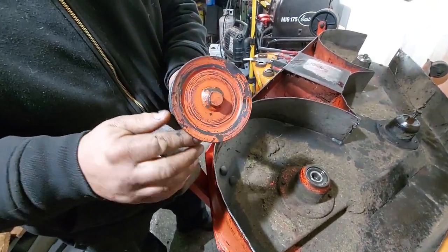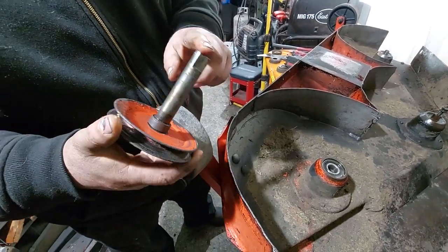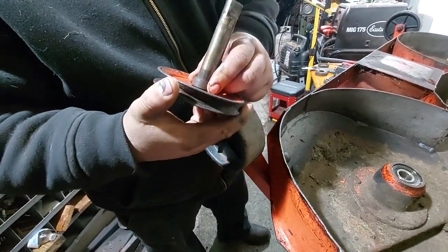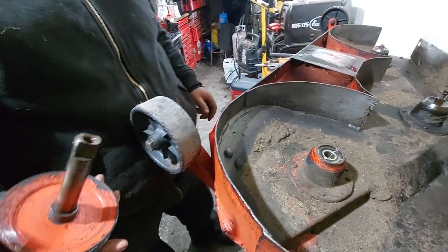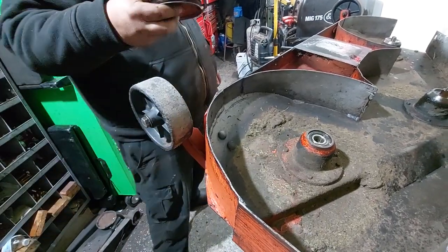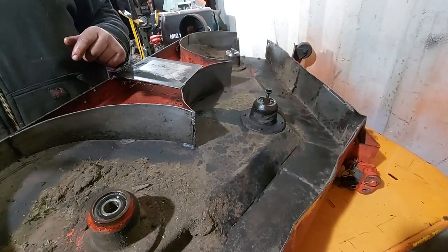That's it — that's how they should come out, doesn't mean they always do. Like I said, the pulleys are welded on here, so if your pulley is shot you're kind of out of luck — you have to buy the whole spindle. We've got a spacer on here, so you have to remember to put that back on. Pay attention that nothing else fell and dropped, as sometimes there are spacers up above. The two outer ones should always be the same, but I always put them back in the same spot. The center one is different — it's got more pulleys on it.